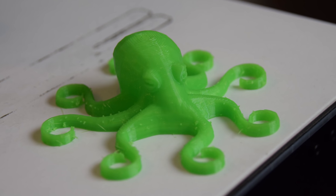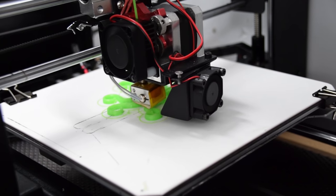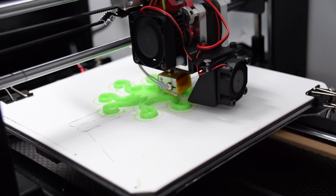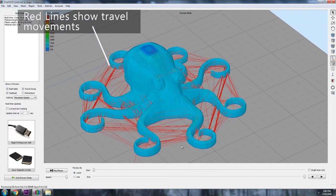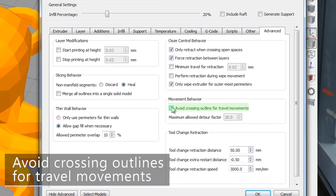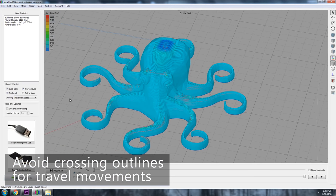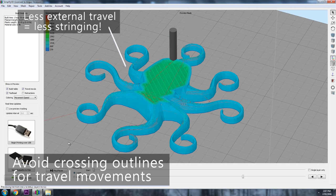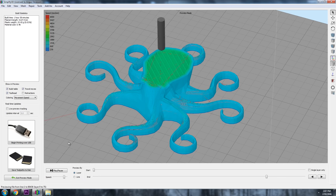As a final pro tip, if you're trying to 3D print with flexible materials like NinjaFlex, you probably want to turn retraction completely off. Retraction will tend to stretch and compress flexible filaments and will most likely lead to a jam in your extruder head. If you do want to manage stringing with flexible materials, there's a setting within Simplify3D called 'avoid crossing outlines for travel movements' which internalizes the stringing into the print. For flexible materials like TPU — for example with my Flexion extruder — I turn this on because it avoids stringing being on the outside of the print. It's not perfect for all prints but it can certainly help when 3D printing flexible materials without too much stringing.